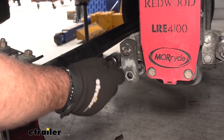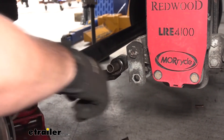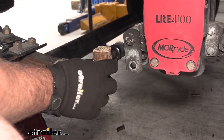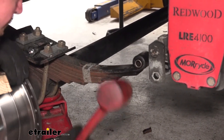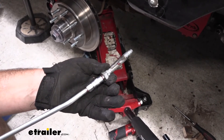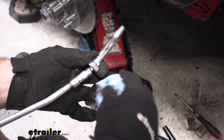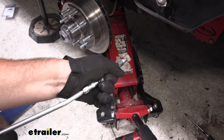Then we're going to take our new bronze bushing and get it put in place. If you find it's not sliding in all the way, take a block of wood, put it on the end, and start to tap it with a hammer to get it to slide in. Make sure you're getting grease coming out of that hole — you can see the old black stuff that will clog it, so make sure you get it cleaned out enough so that when you grease it after installation, the grease will flow through.